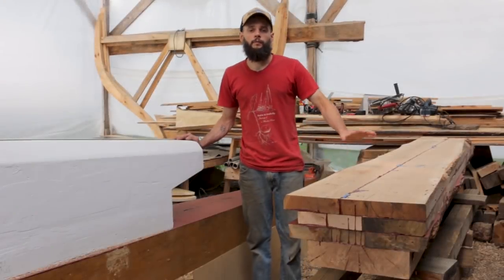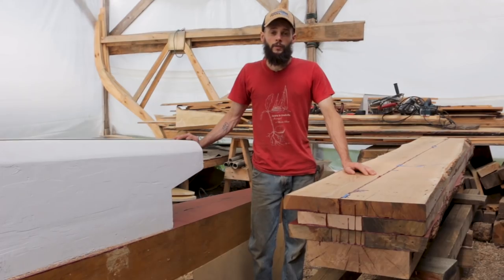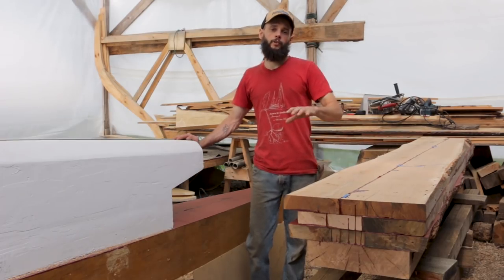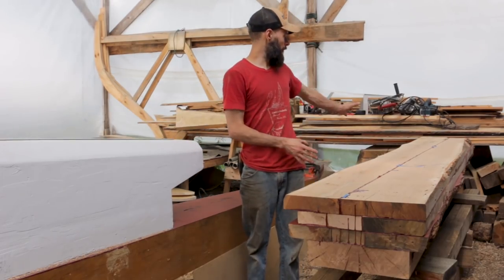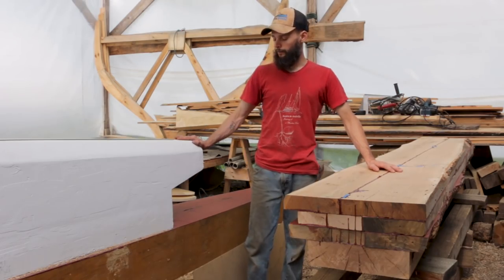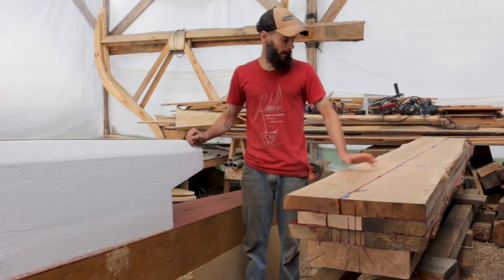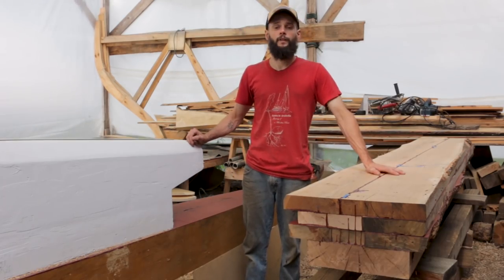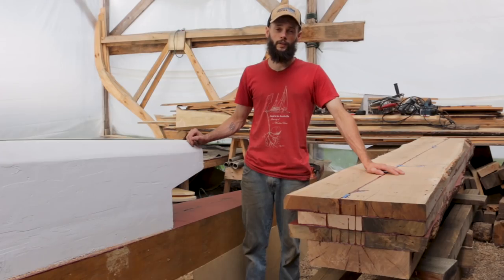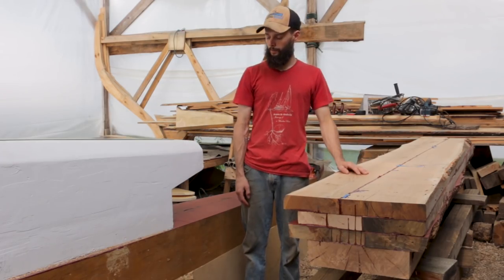Yesterday we put the last lamination on the big Deadwood assembly here. And this morning I flipped it over, set up some rails, and carefully rolled it forward so that it's much closer to where it needs to be. And it'll make taking measurements and transferring them a lot easier. So right now, basically the bottom is up and we'll start cutting there since that's the widest part. And eventually today we'll flip this over and do some more shaping on it.